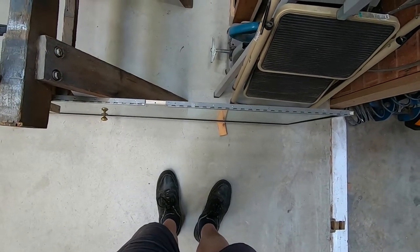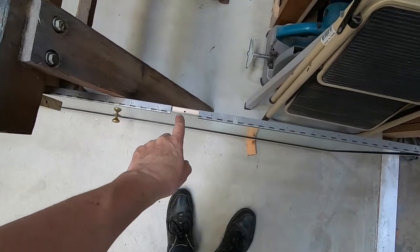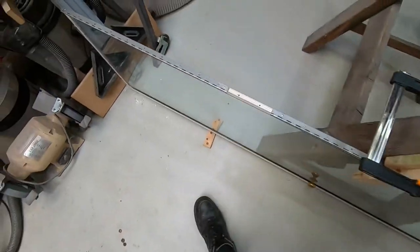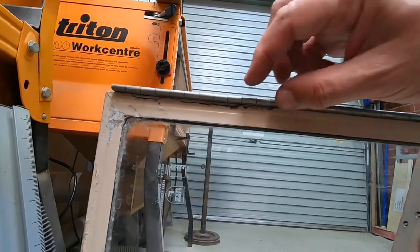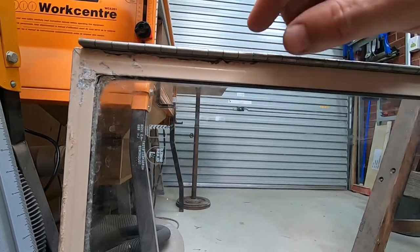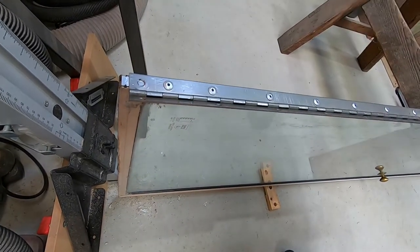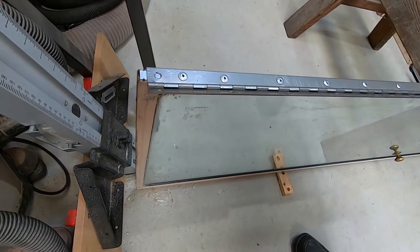And I had to do a bit of work on the frame as well, because as you'll see, this lip on the front at the bottom of the frame was just corroded away. Had the same issue here, of corrosion. You can't really see it, but I put in an aluminium shim underneath there. You can just see the end of it poking out, and that was to make up for the fin that was corroded off, so the rivets would have something to pull up to.